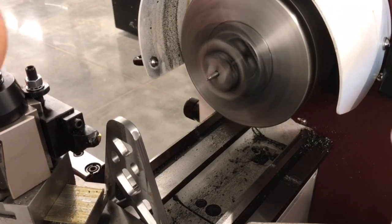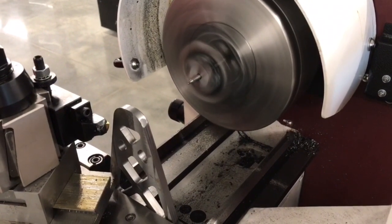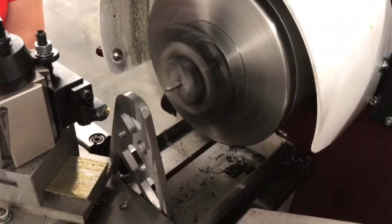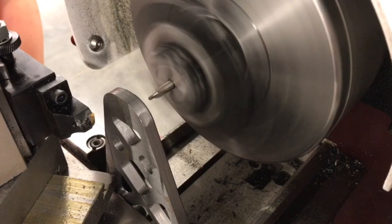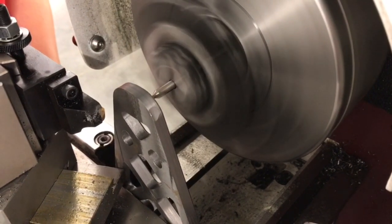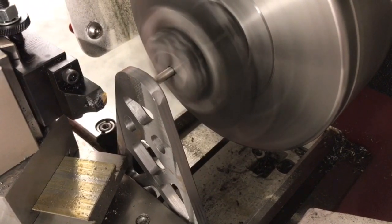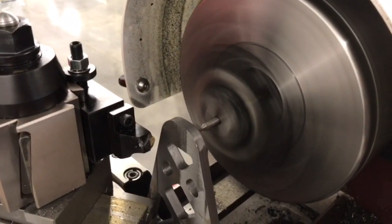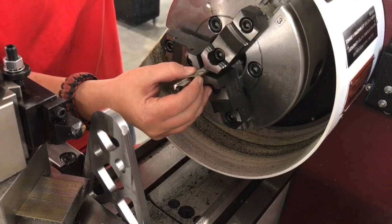Once you get the piece mounted on the machine, you have to drill and ream the hole. Like with any drilled hole, you want to do a center drill hole location first. That center drill is going to help guide the drill bit and keep it going where it's supposed to be, and keep the drill bit point from walking off. So what we did is clamp the center drill into the lathe chuck itself and bring the carriage over until we located a little start hole. This start hole helps guide the drill bit tip just like it would on a standard drill press or milling machine. After that, we would trade this out for the drill bit that was necessary, then change out for the reamer. These steps will allow us to get the hole in the exact location and to the exact size it needs to be.